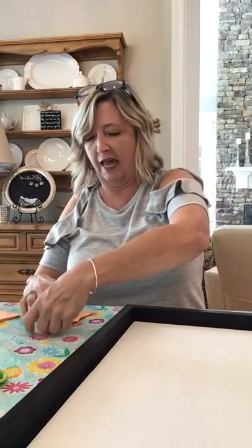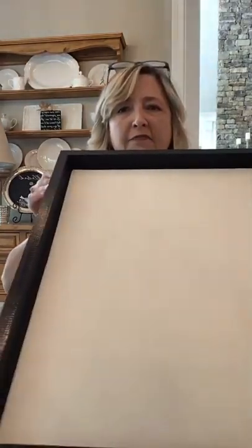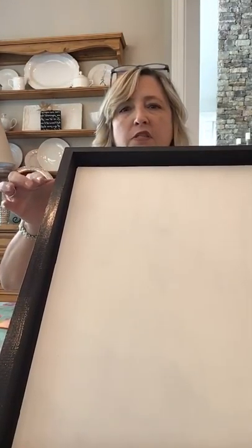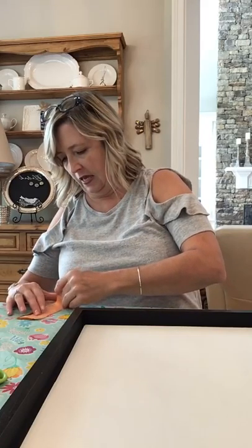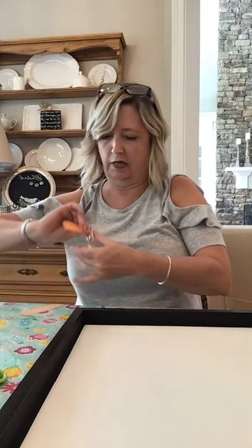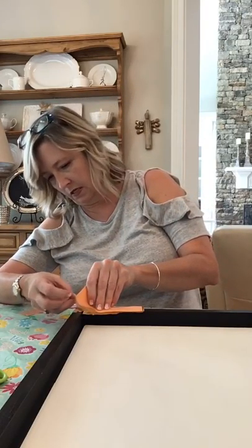So I have these little pieces and I applied the gilding size about 10 minutes ago. When you put it on wood it really soaks in quickly and it comes to tack — tack is the special word that means the glue is the right stickiness. You can kind of tell because it gets a little translucent looking and kind of almost has a greenish sheen. I'm just going to pick up my book — that's what they call it — and lay it on, then burnish it.